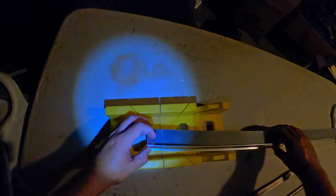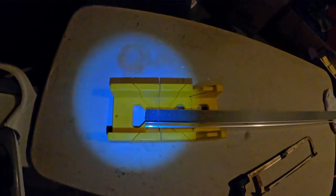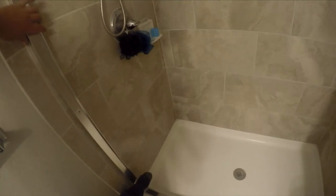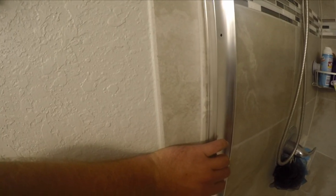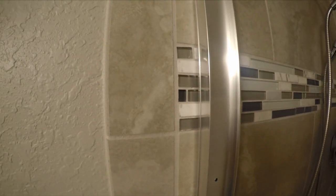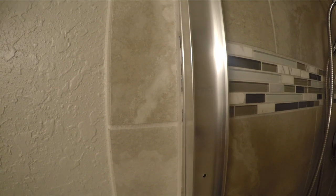Make sure you're making straight lines so it's marked properly, and just keep sawing it perfectly straight all the way through. Before placing anything, you want to know where your side rails will go — you can move them to follow a grout line. Looking at my tile, I'm going to bring it over to cover that area and follow that grout line.